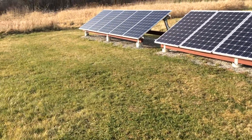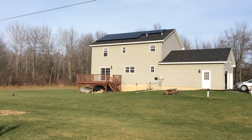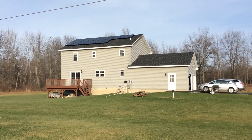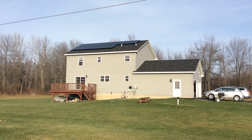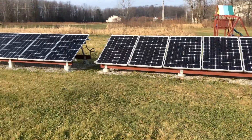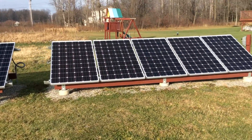When you build a solar array you definitely want to go south facing, because you're going to have sun all the time, even in winter you'll get the low sun. The issue with a west facing array in winter is that the sun is so low it doesn't get quite all the sun it needs. With a roof array you can get snow buildup — I've gone a whole month of January not making any power on the roof. But with a ground array I can maintain it, brush off the panels and keep it going.